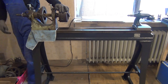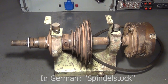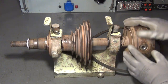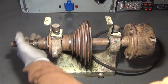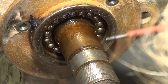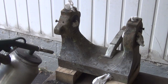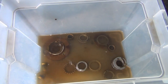This is the point where we had arrived after my last upload on this topic. Now it was time to restore the old headstock. The headstock had to be disassembled into its individual parts — the central hollow spindle carrying the three-jaw chuck at its front end had to be pulled out of the central cast iron part. Two screws on the rear end of the spindle had to be unscrewed and the heavy cast iron pulley in the middle had to be loosened. While rotating in a simple bushing at the front, I found an actual ball bearing at the back side. Again, a lot of these parts had rust, old paint, grease, or other dirt on them, so a lot of cleaning and de-rusting had to be done. The central cast iron part was sandblasted, and so was the chuck. The smaller parts were submerged in gasoline to degrease and then carefully de-rusted, only to be re-oiled.